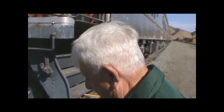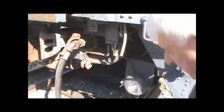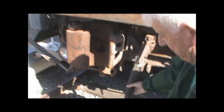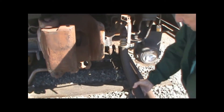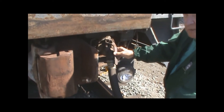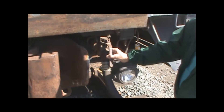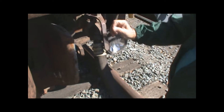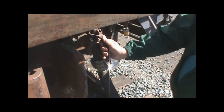When I was a brakeman on the railroad in Sacramento, one of the things we had to do when connecting the cars was work the airbrake hose — that's this. And for safety reasons, you hold it against your knee like that, so that when you open the valve, it doesn't kick away. Because if it kicks away and you're not holding onto it, it can hit you in the knee. So you had to learn to hold it like that and then work the handle — that's a safety precaution.